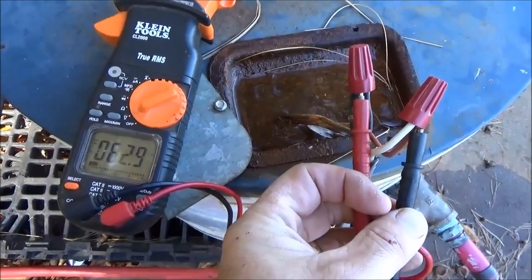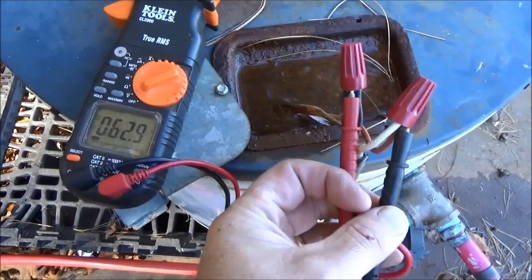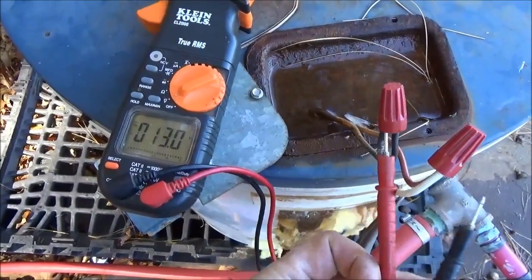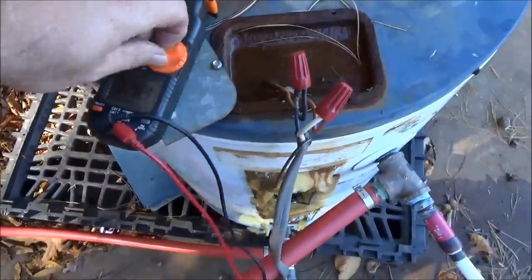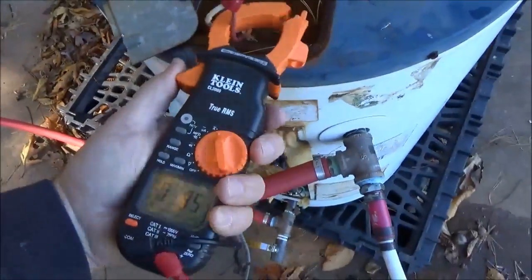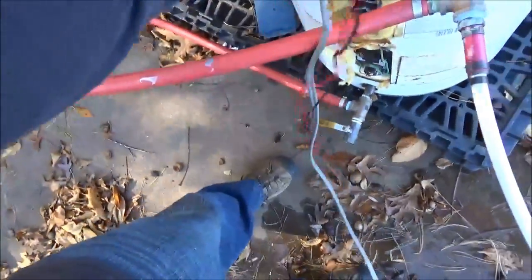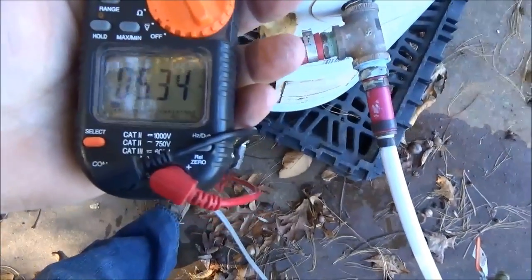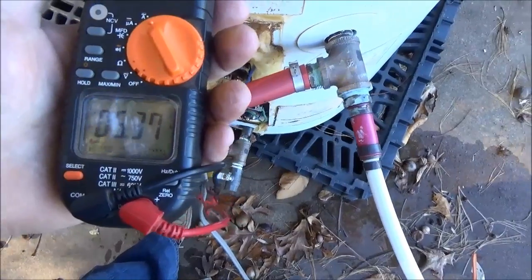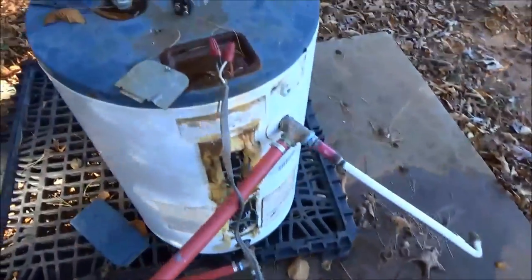Not a very good test since two out of four panels are in shade right now — about 62 volts going to the element; before it was closer to 100. I just want to show I am reading voltage off of it. We're doing the right polarity — 55.4 volts. This is towards the end of my test, so 5 amps times 60 volts, that's about 300 watts going into the water heater.